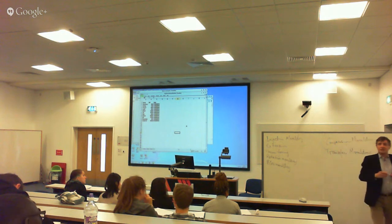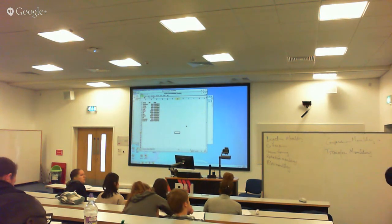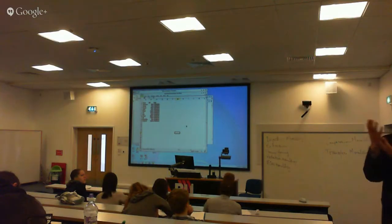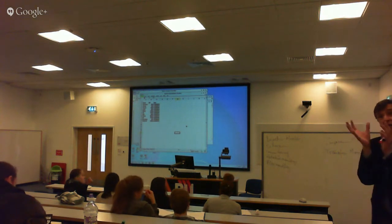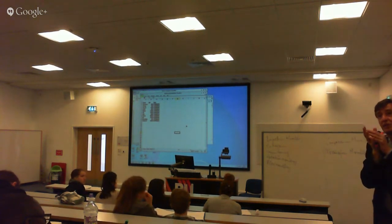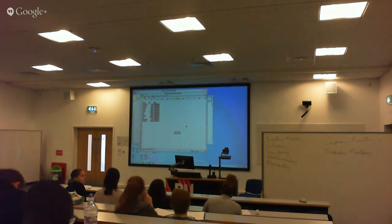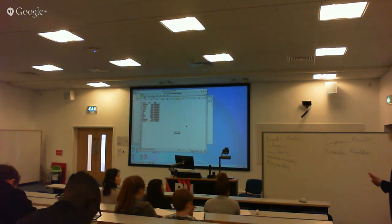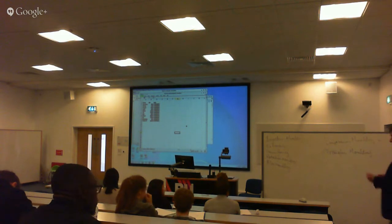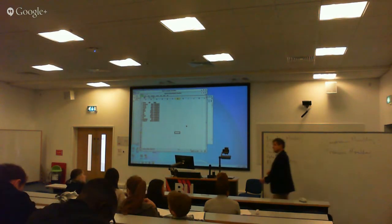A similar process, you should know, is called transfer molding. It's more or less the same thing. It's compression molding, except that it's done in two stages. In the first stage, the plastic is sort of half heated, not fully heated, and not pressed. The second stage is pressed and more heat applied. The fact that it's transferred from one stage into another is the reason why they call it transfer molding. Essentially, the mechanics are the same.